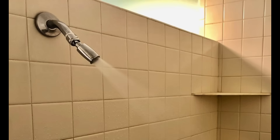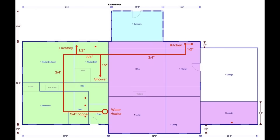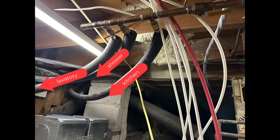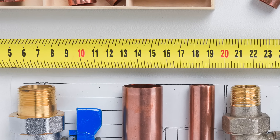The three fixtures were the kitchen sink, our bathroom lavatory, and our bathroom shower. The way I did that was to use smaller pipes and shorter runs. Instead of sticking with the trunk and branch system that the house came with originally, I designed a home run system for those three fixtures. I made a manifold out of copper fittings and copper pipe and ran PEX tubing from that manifold to those three fixtures. You can find the parts we used and how we did this in the description below.